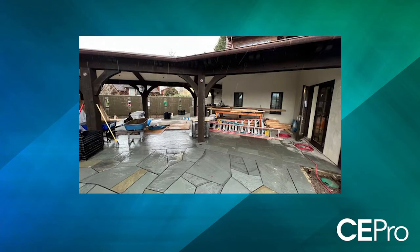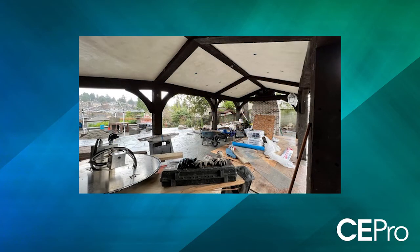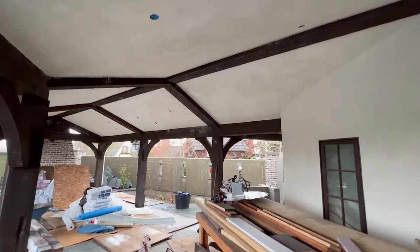And the second step was that on that project, we then installed 4 LRX, actually it was 6 LRX 83s on an outdoor patio area in the ceilings, where they then applied this plaster. And we followed the same logic in that we measured the frequency response before and after, and then did the DSP adjustments. And it worked out great, actually.